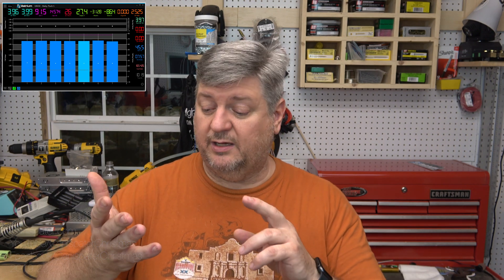So I went ahead and replaced those cables with number four gauge cables, which are rated at about 75 amps. The breakers are rated at 63 amps, so that's kind of where the cutoff is - close to a thousand watts. It just gives me a little more headroom and I feel like it's a slightly safer setup.